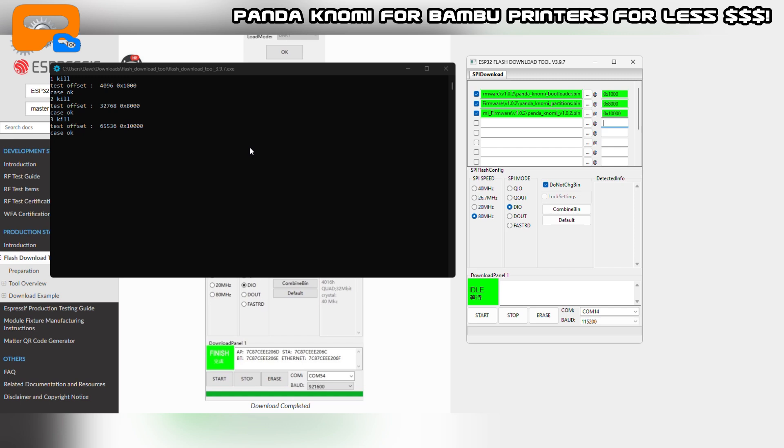Leave SPI mode as DIO, do not change. Select your COM port — double check when you plug it in via USB. For baud rate, I've been using 115200; that makes a stable transfer when you're moving firmware images. I don't want to speed it up and risk bricking the device if something goes wrong. I'll fast forward so you don't have to wait, but I'm starting the process now. You'll see in this window it checks the three memory addresses — and then it tries to connect.